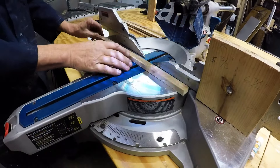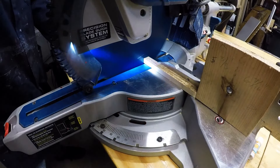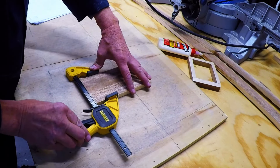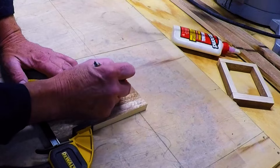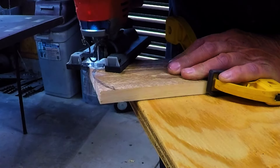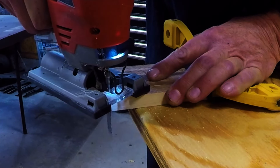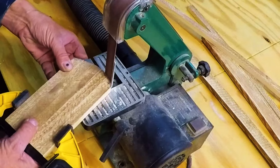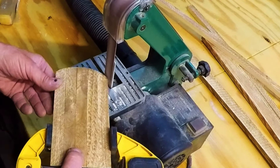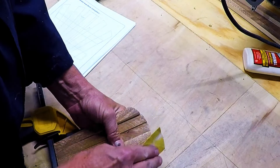Now for the back, I'm cutting five pieces of three-quarter-inch board at eight inches long. I laid out the colors the way I liked it, kept everything straight, measured down five-eighths of an inch on both sides, and then free-handed a curve in there. To cut out the curve I used a Milwaukee M12 jigsaw — the link for that saw is going to be in the description. I'm using a Central Machinery belt sander from Harbor Freight to smooth out the corners, then just hand-sanding the sharp edges off.